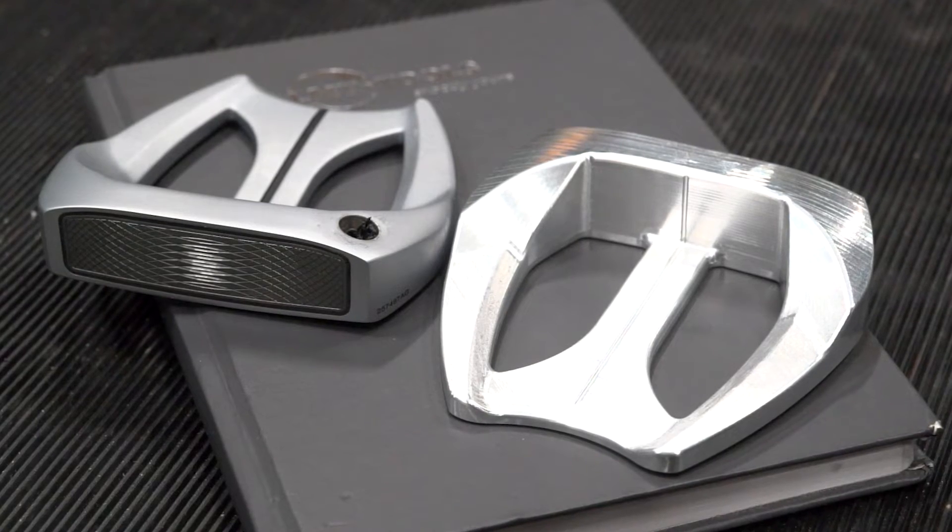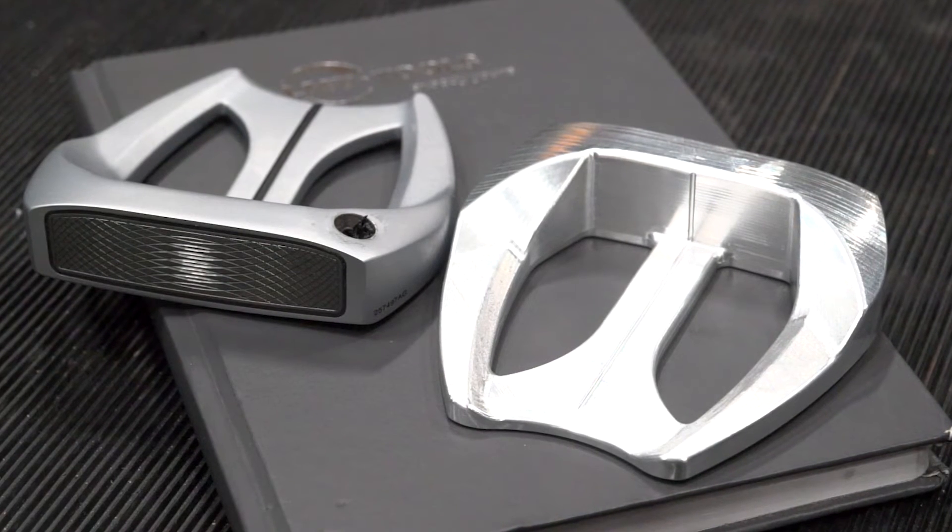If you were using a ball nose previously, you'd only use the bottom part of the cutter. The advantage of using this over the traditional ball nose, in conjunction with the five axis machining strategy, is that you're not cutting on the center of the tool — where a traditional ball nose would have a surface speed of zero. This improves machined surface quality and decreases cycle time.